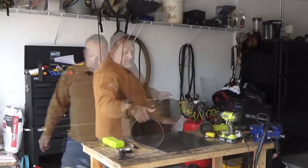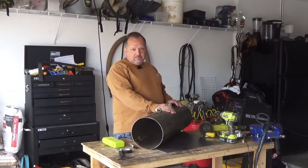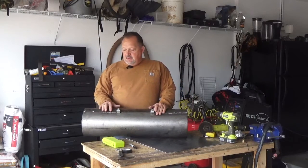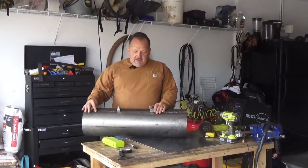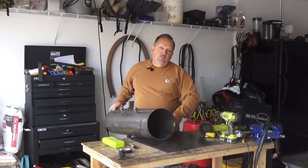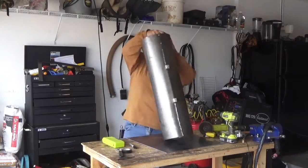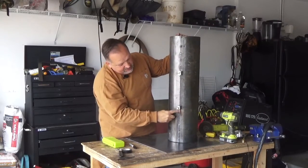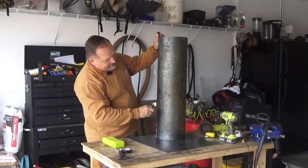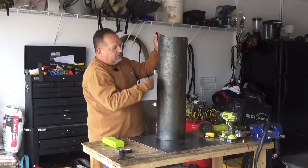I'll show you the tube — I don't have the roller, so this is 1/8 inch material, and I had one of the local fabrication shops roll it out for me. I did the welding — we welded it right here and on the inside as well. These are just some clamps to keep the gap, and I played around over here with a flux core welder. This is going to be cut out — it's only going to be welded this far because this is what's going to go into the 8.5 inch diameter hole that goes on the end of the trommel tube. This line here is going to remain cut — I'm not going to weld it. I'll cut that out right there, and this welded section will extend inside to the trommel tube.